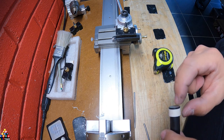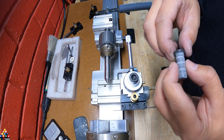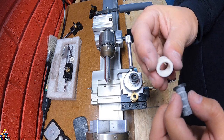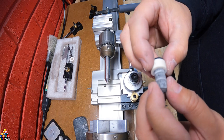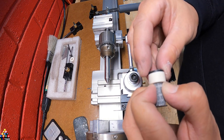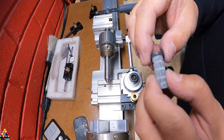So you try to make it how the original was, and this is what I'm doing so I can get the original length. I forgot to record this video, and as you can see, this is what I did on the G10. The stem itself, I put this a little bit deeper because this is where the ferrule is going to be at. That way the glue can actually bond with this and be better. And then this is where it's going to mate with the carbon shaft. And of course with this held on this way also, so that it shouldn't have that vibration. You don't want this so smooth that the epoxy has nothing to grip.